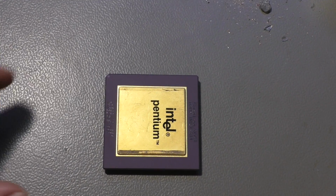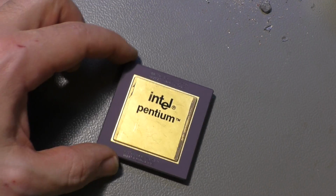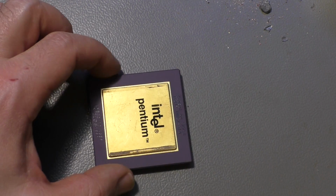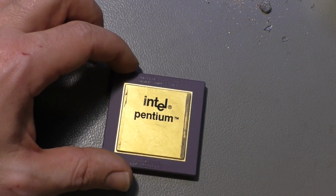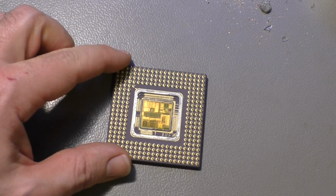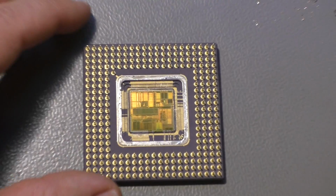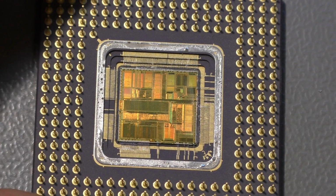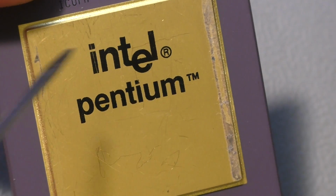Indium is also used to bond the silicon chips inside Intel processors to the heat spreader. You can see that here, that's an old Intel Pentium, but if you take a new Xeon processor or whatever desktop processor is actual right now, and if you open that, you can see the silicon die here inside, which is upside down, so the bottom of the die is soldered to the heat spreader here, where the heatsink then is mounted,